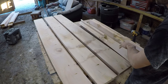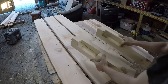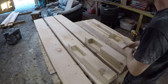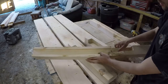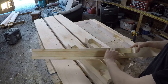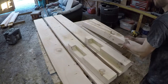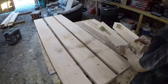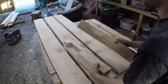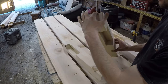I have two 4 foot chunks and another two 2 foot chunks, and they've been notched out to fit the side and end pieces. These longer ones have been notched out with a table saw — an inch deep, 2 inch wide track for the headboard boards to fit into. I just have some pocket screws to attach them together, and on the tops of these 4x4s I used a chop saw to make a nice little chamfer on the edges.